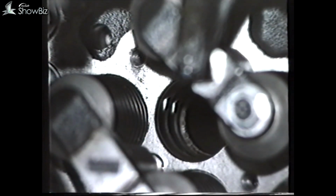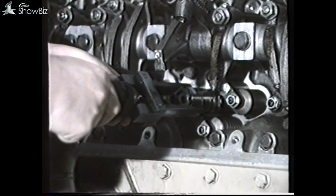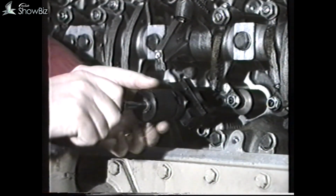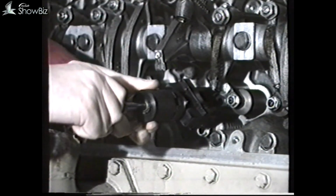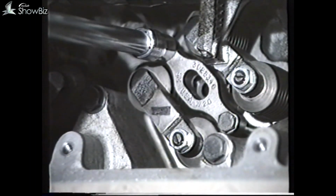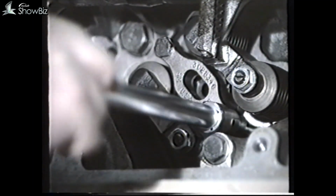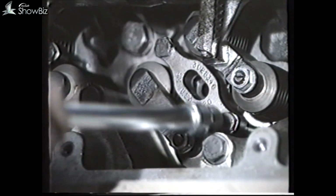Make sure that the injector hole is clean before replacing the injector. Lubricate the seals and push the injector into place. It should, if located properly, snap into position like this. Replace the clamp and tighten the nuts evenly to a torque of 15 Newton meters. Failure to comply with this requirement may cause damage to the injector or jam the injector plunger, causing a misfire.